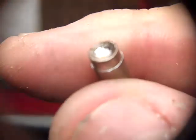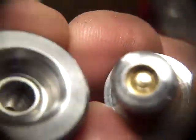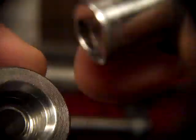That rebate you want, 10 thousandths of an inch, or wait, 100 thousandths of an inch. But it's a little flexible. You got between like 70 and 100, but 100's the best. So, that is basically how it works. They get squished in there, and where these two surfaces meet, they form like an anvil type cutter to cut off that excess lead.